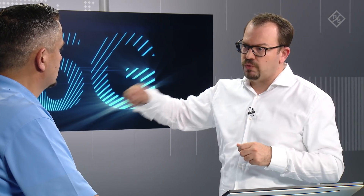These values also have an impact on tolerances and measurement uncertainty. If different regions within the quiet zone have different deviations, this directly impacts your TX or RX measurement. The other parameter we look at is amplitude and phase ripple, which relates to faster, more local variations in the quiet zone — not the deviation from uniform, but local variations. These can be due to many factors including reflections, interaction with the environment within the chamber, scattering from the feed, and scattering from the reflector itself. Typically we look at ripple in amplitude of plus or minus 0.5 dB.